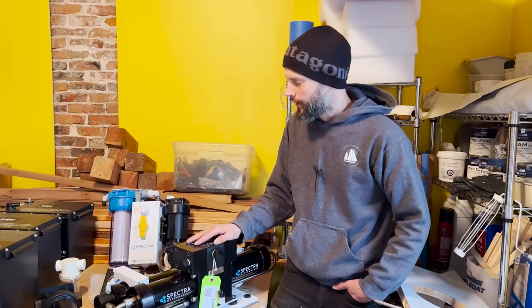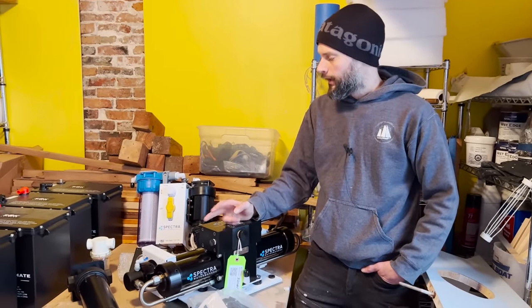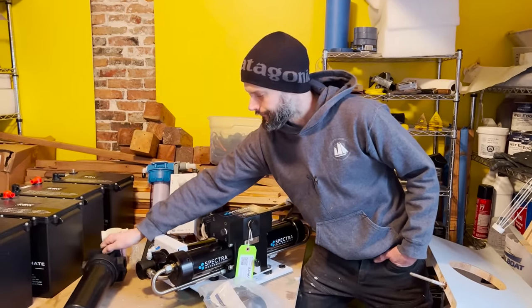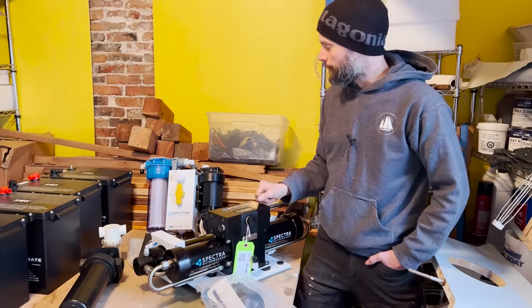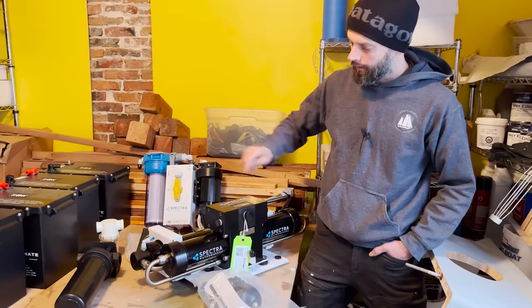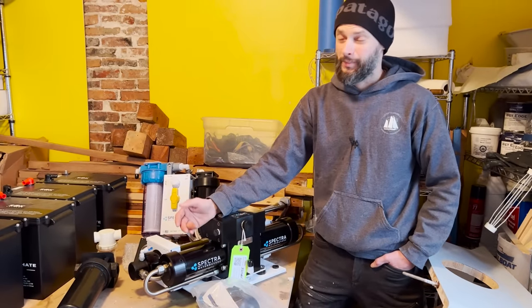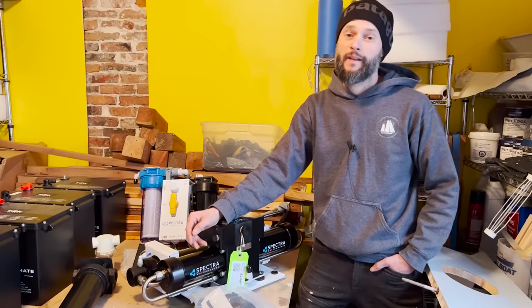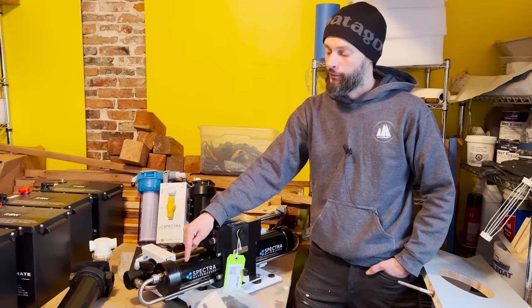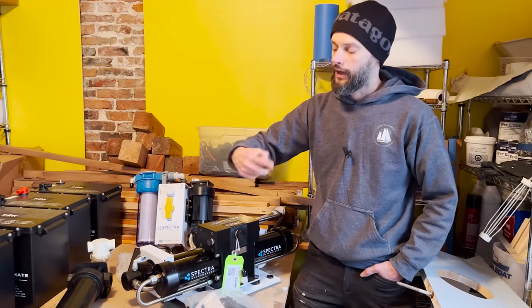How the water maker works is it's pretty simple. It needs its own through hull, so it should have its own inlet, its own strainer, and its own exit. And it will go through a primary strainer and through a secondary strainer, and it goes into the high pressure pump. Actually, here's even a third strainer. It goes into the high pressure pump, and it puts the salt water into these two metal sleeves here that have membranes in them, and it jacks that salt water up to, they're all a little bit different, but 800-900 psi, somewhere around there. And what happens is at that high pressure, it forces fresh water through the membrane, which then gets sent out and into your water tanks, and it sends the remainder as brine back overboard.